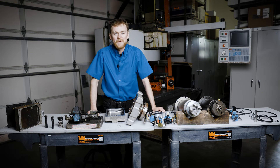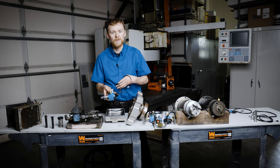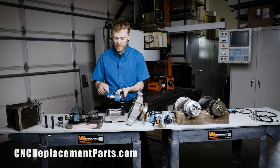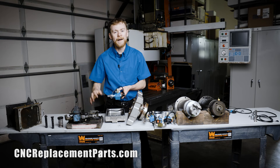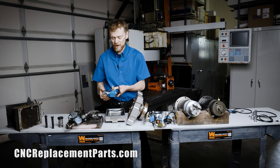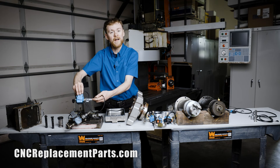If you're having problems with your tool release piston — if it's banging, if it's being sticky, or not working correctly all the time — I would recommend replacing the main clamp unclamp valve and also the quick exhaust valve. CNC replacement parts offers a rebuild kit that comes with the fitting and the quick exhaust valve. You can also just purchase a rebuild kit for the quick exhaust valve, but if your machine is old and these are both original, I would replace them both. It's far easier, from my experience in the field, to unthread this and replace the entire assembly than it is to try to reuse the fittings. This will fit right in here, and you'll hook up the pre-charge valve here.